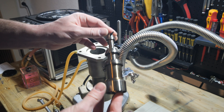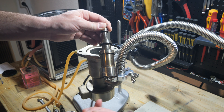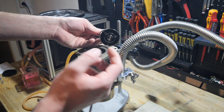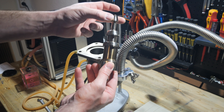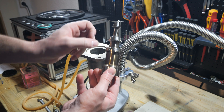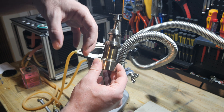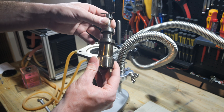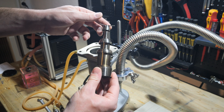Then I'll insert the jet assembly stack, also called the Christmas tree. The oil vapors will be heated by the heater at the bottom, vaporize, travel through the stack, and be redirected by these three cups — which are three compression stages — downward, where they transfer their momentum to gas molecules still in the system and carry them down to the fore-line pump where they can be evacuated.